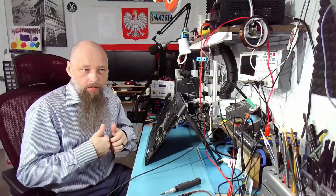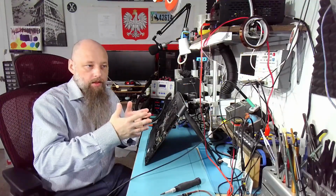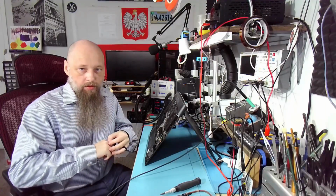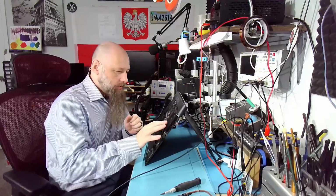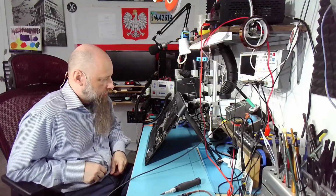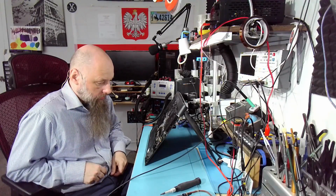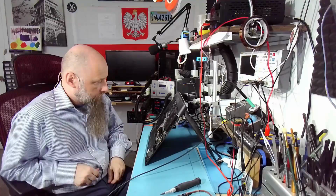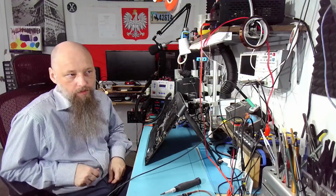If the SAM is controlling the MOSFET, because it might not. It might control some other driving chip that delivers power, and it just tells it to deliver or not deliver. And there might be a short to ground, which would explain this behavior as well. Well, it looks like we need to disassemble the entire board, dig it out, and inspect it and look for shorts.